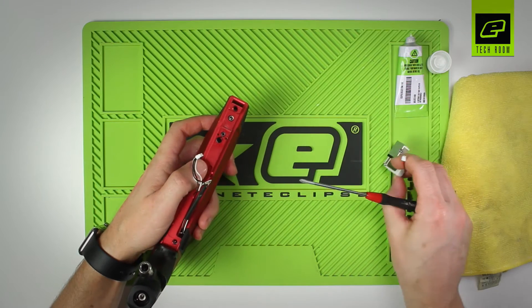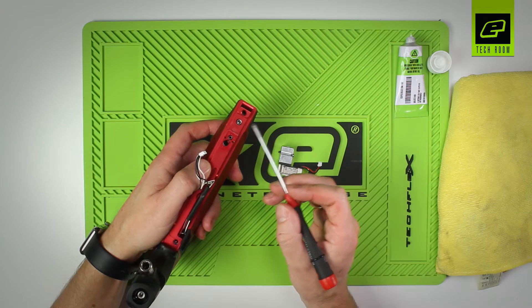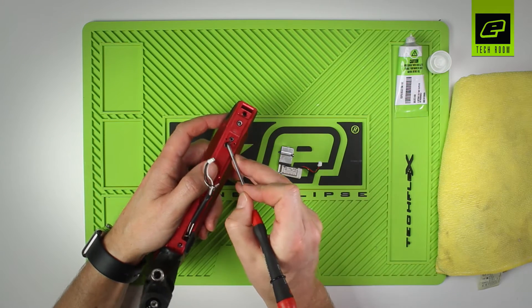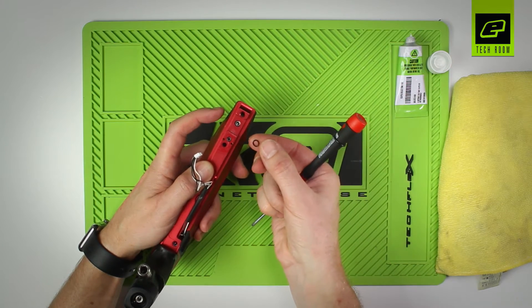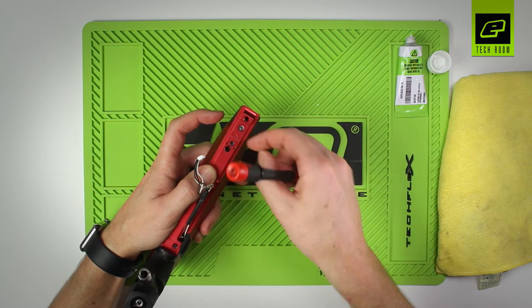Lift that away. Before we go into more detail of the solenoid, you can also see two gasket O-rings here. This is a 3x1 O-ring and a 5x1 O-ring. These are just standard O-rings — even though they look shaped, once they pop out of their pockets they're standard O-rings. Make sure that they're in place and have a light application of grease on them prior to reassembling.